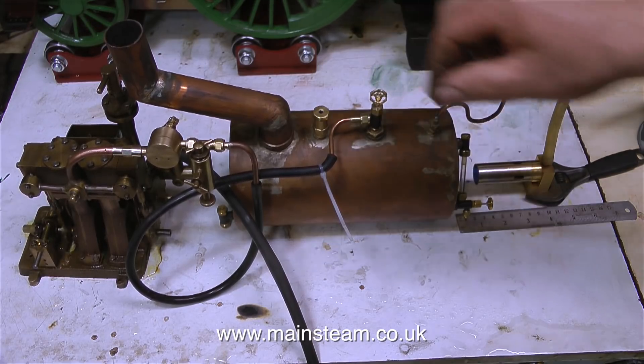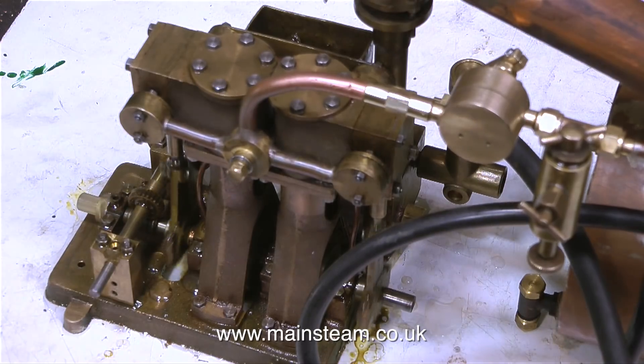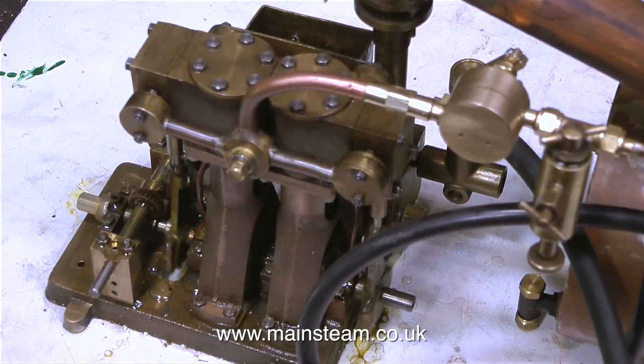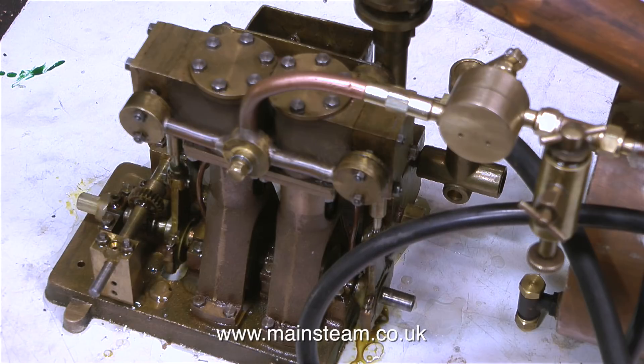What this means is that the burner mounting, which will obviously be hot as it's attached to the burner, will be right next to the brass water tank. That's a very good thing, because some of the heat is going to radiate from the gas burner to the water tank and make the water ever so slightly warm. And if you've been following the rest of the series, you'll realise that inside the water tank is the gas tank. The radiated heat from the gas burner mounting will try to warm up the water in the water tank, but it won't, because the gas tank has been very chilled by the evaporation of the gas inside it that feeds the burner. Underneath the gas tank, fastened into the boat, will be a brass plate, and it's to this brass plate that I will attach the gas burner.